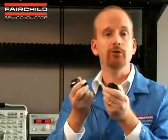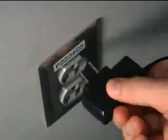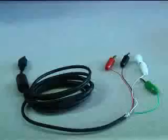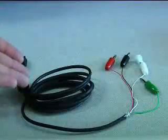This connection is similar when the mic input is placed on the D+ line, except that the headset audio will be in mono mode. Now let's look at the other prominent feature of the Fsa800, the charger detection feature. I'll show you how this works. The dedicated charger is attached to the micro USB port and is plugged into an electrical outlet. It detects the charger by looking for a valid V-bus signal and checking if the D+ and D- lines are shorted together.